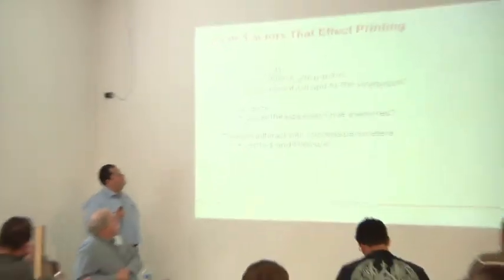So we talked a bit about paste rheology. Why is the rheology important? How well the paste fills the aperture as you shear thin it. Powder size — why does powder size matter? Fit through the apertures. So why not just go with the smaller powder size for everything? Oxidation — it breaks down faster. Cost is another factor. And they all interact with the speed and the pressure like we just talked about.